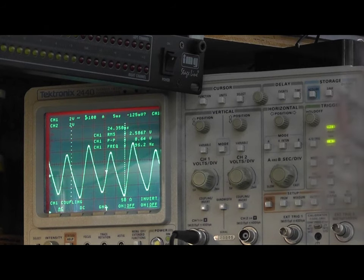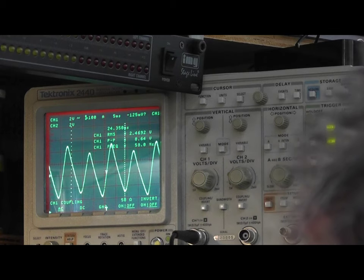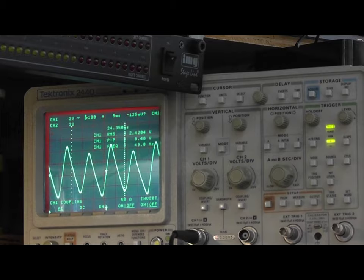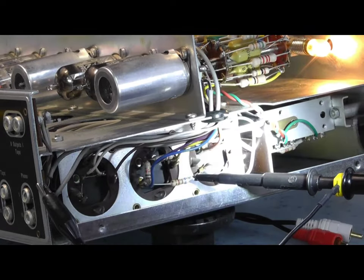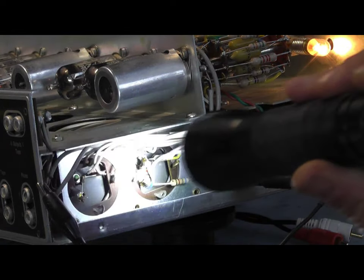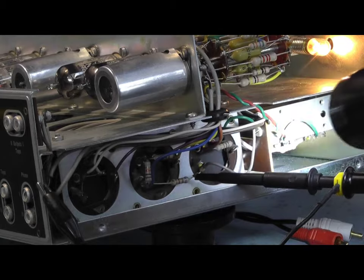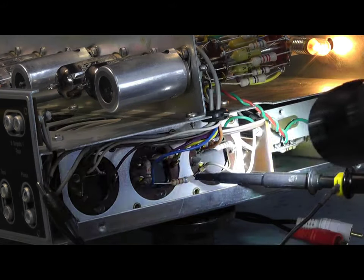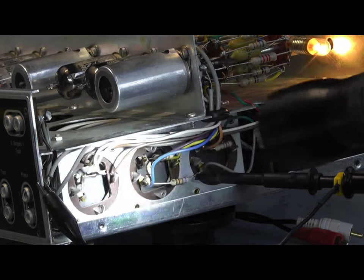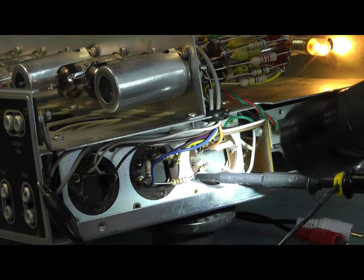What we'll do actually when we've gone through and checked all these capacitors, which appear to be fine, is check to make sure there's no hum on the output. We could change the capacitors for something more modern, but as I say again, it's going to be a major rework on the amplifier itself. You can see these are the capacitors here. And quite honestly, I'm quite happy with the way these capacitors are performing. Nothing's getting hot, even though these caps are old. The seller didn't really want to just change components willy-nilly. He'd rather try and persevere with it. And of course, if there is a problem with this amplifier at a later stage, we can always bring it back and recap the whole thing. But I really don't approve of that. I know a lot of people do. These caps appear to be okay.